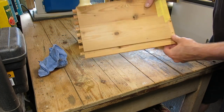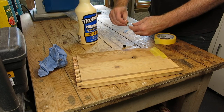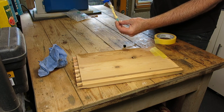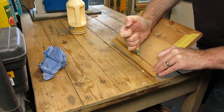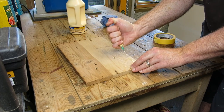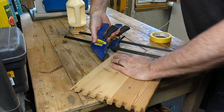As you can see there, this is another repair that needs to be done. This one's just split, so it doesn't need a new runner. So I finally got my glue syringes that I'd ordered a while back. So basically just fill your syringe, squeeze as much adhesive as you can into the joint, wipe the excess and clamp it and leave it to dry.